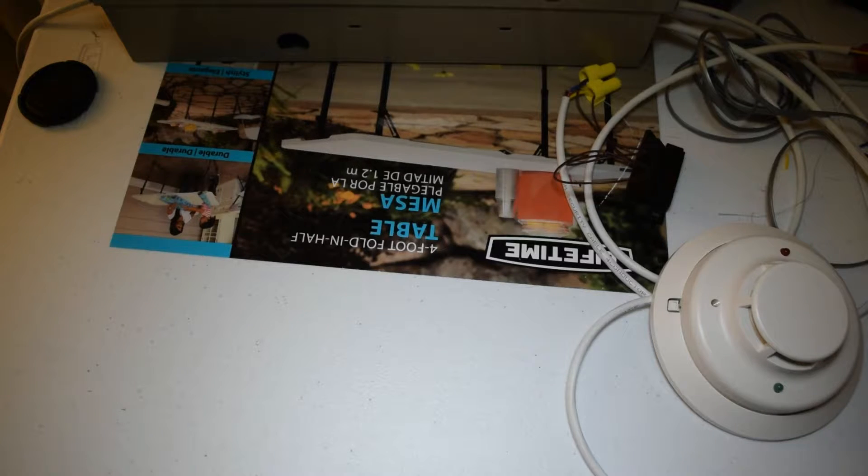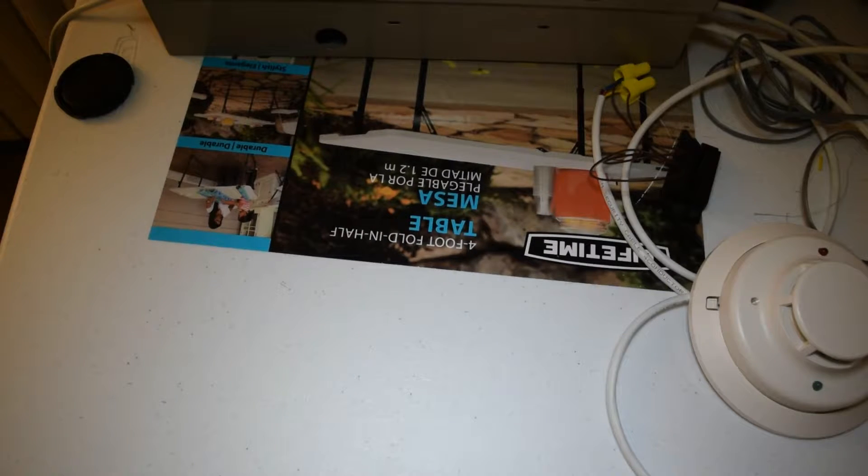Only do it the bridging way if you're doing it for experimentation purposes or a home lab purpose, just like this one. But definitely do not do that on certified UL installations. The way I'm going to show you how to wire in a phone line onto the panel is the line seizure method.